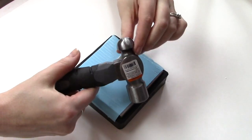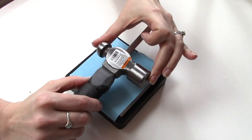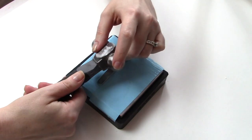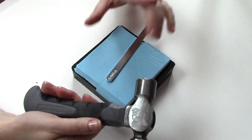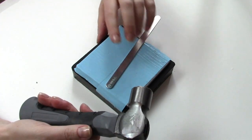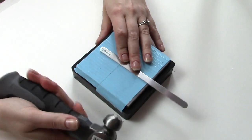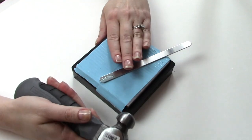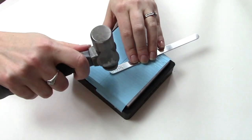So remember I told you when you bought this hammer to make sure that you got the ball peen hammer instead of the claw hammer. And that's because we're going to use this end here, the rounded end, to make some texture on this cuff bracelet. And then we can add it to our stack and it'll stand out a little bit from the last one that we did. So what we're going to do is we're going to use this ball peen end to just lightly tap all over the entire surface